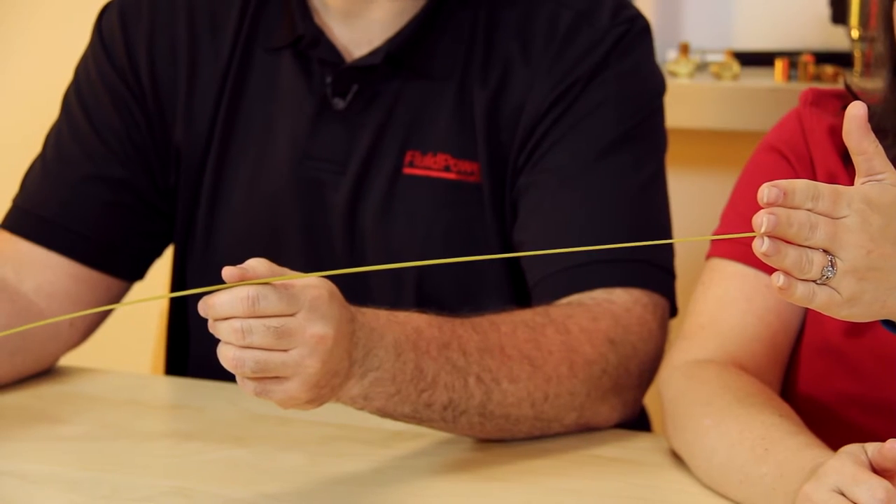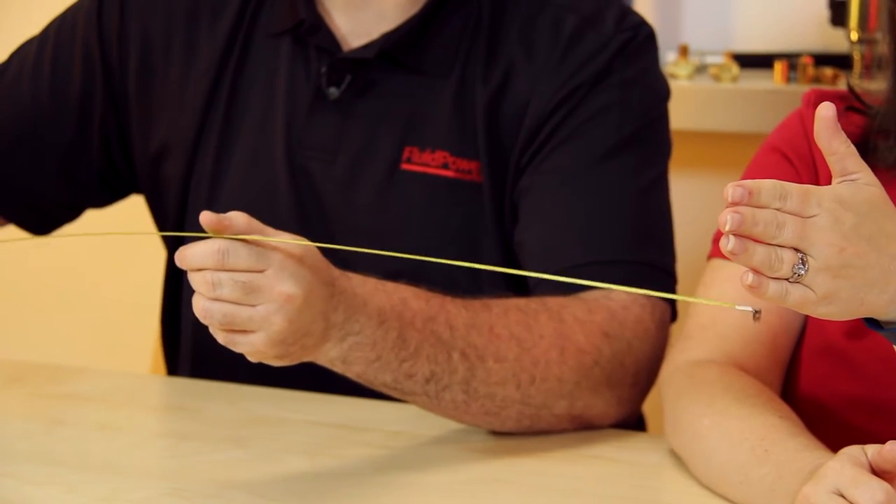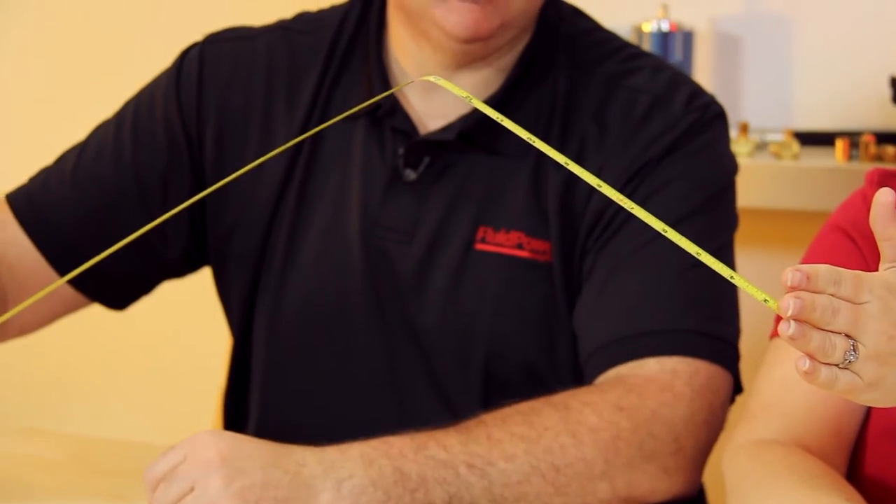So that's all the common mounting styles. Can we go back to the side loading and column strength issues? Absolutely. An analogy I like to use for when a rod extends toward the end of a cylinder stroke is when you're using a tape measure. You've likely discovered how many feet you can get the tape to extend into free air before it bends, dropping with a boing clank sound. The longer the cylinder stroke and the farther the cylinder extends along its stroke, the higher the rate of potential for two common cylinder problems: side loading and column bending.